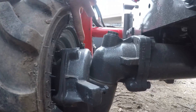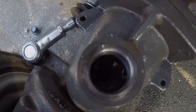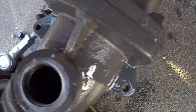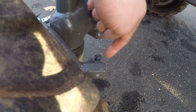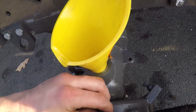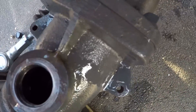To refill the axle, remove the breather plug on both sides. Begin refilling the axle through the fill plug. Take your time and add a little bit of fluid at a time. Wait for the fluid to go down into the axle and then continue to fill. This will take 4.2 quarts of fluid. Massey Ferguson recommends filling until the fluid is halfway up the axle shaft. Once you have reached this point, wait a few minutes as air will escape from the axle and the fluid level may drop. I had to fill and wait several times before the fluid level stayed at halfway. Once you are done, reinstall the breather plugs and the fill plugs. I recommend coming back after a day or two and rechecking the fluid level in case any more air has risen to the top.